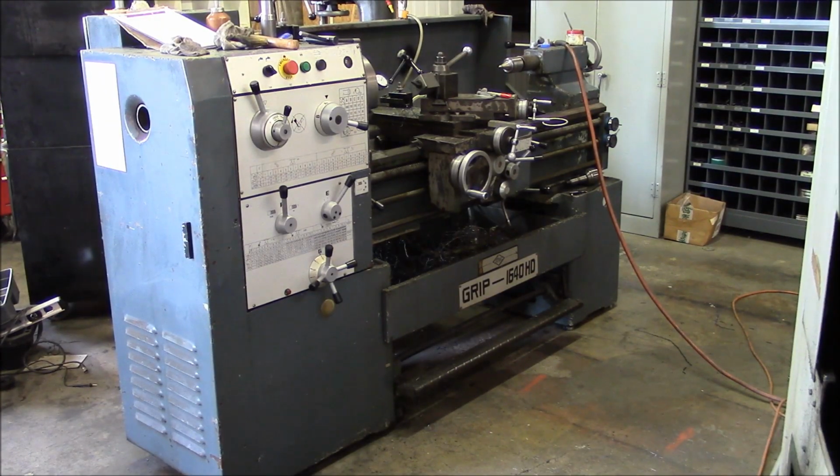As a quick follow-up to the spindle bearings, there's no complicated run-in procedure for these bearings because they're oil bath bearings. If these were grease-packed bearings, we would have to go through a pretty complex ramp-up procedure to make sure that we get the grease distributed correctly inside the bearings. But since these are oil lubed, it's not that big of a deal. All I really did was just run it for, I don't know, 4 hours, something like that, at a variety of RPMs, and just checked the temperature, and everything was good. I double-checked the preload. Everything seems to be fine. So yeah, I'm very happy with the way it turned out. Those bearings are expensive, but that's the heart of the machine. So if you don't have good spindle bearings, you just can't make good parts.